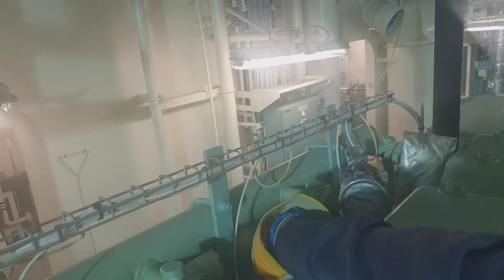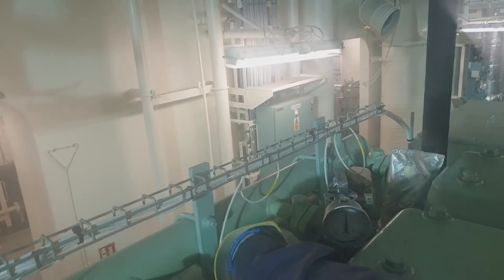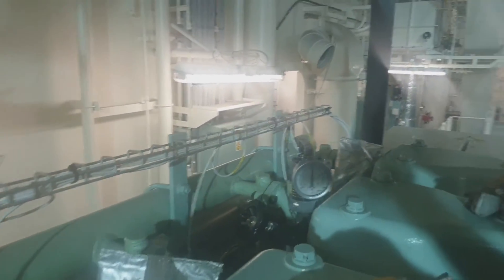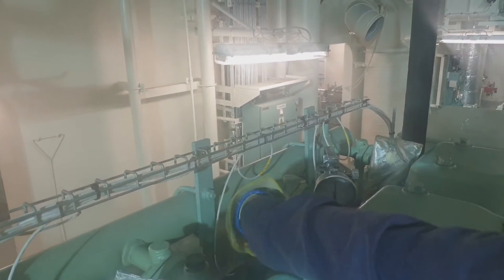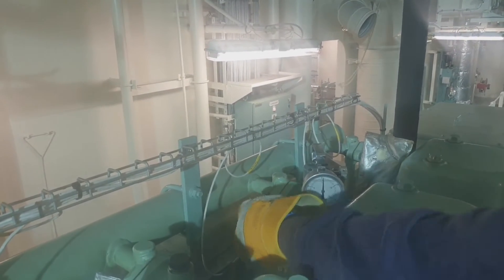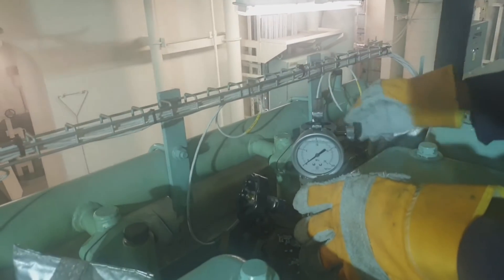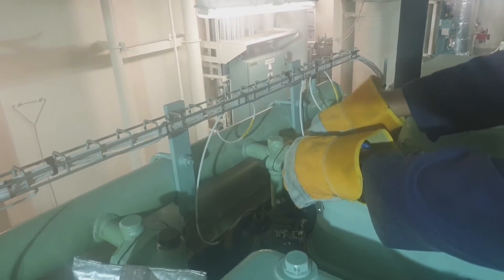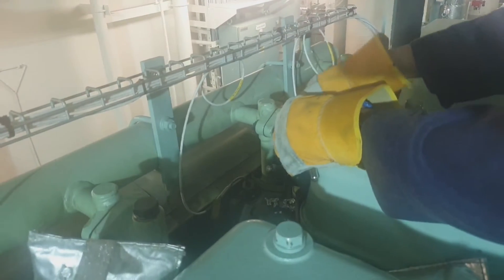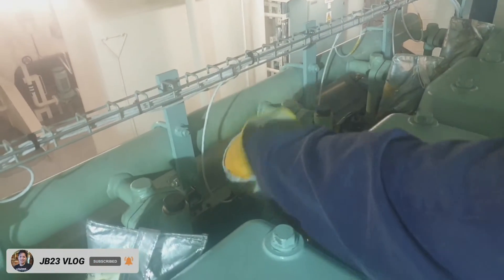After 3 to 5 seconds, read the maximum pressure at the gauge. As a precaution, the indicator valve has to be opened while reading the maximum pressure, and the measuring duration should not exceed 30 seconds. Then close the indicator valve, open the valve screw, disconnect the maximum pressure indicator, close the valve screw, and repeat the same procedure for the remaining cylinders.